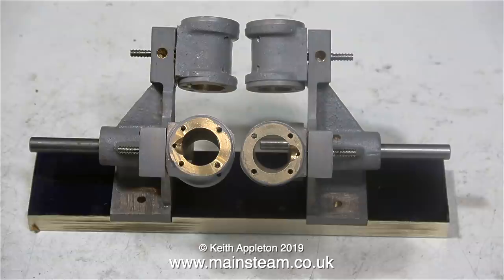As you can see, the two engines fit into the slots, but the left hand slot is slightly wider than the right hand slot to allow a little bit of adjustment. I just have a sneaking feeling that when I assemble the finished engines I will need to slightly align them. At this moment in time I am not 100% sure that this arrangement is going to work anyway. I will find out in due course when the engines are bolted to the piece of brass and the crank webs are fitted with the extended crank pins, which will be held in alignment with a fine machined piece of phosphor bronze.